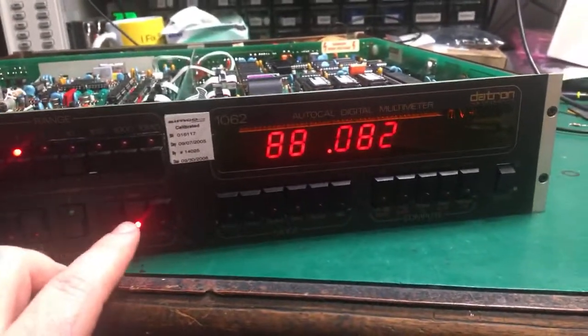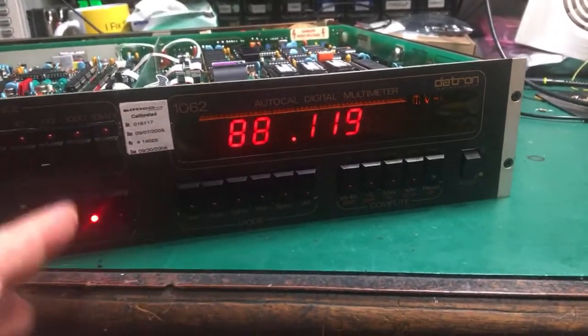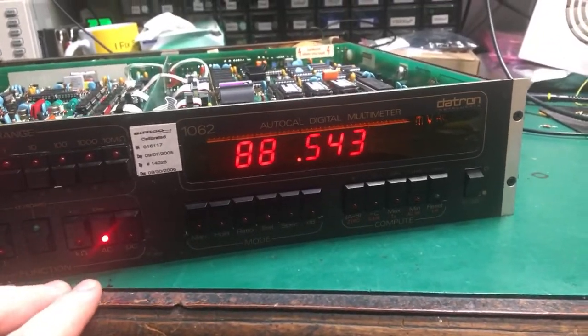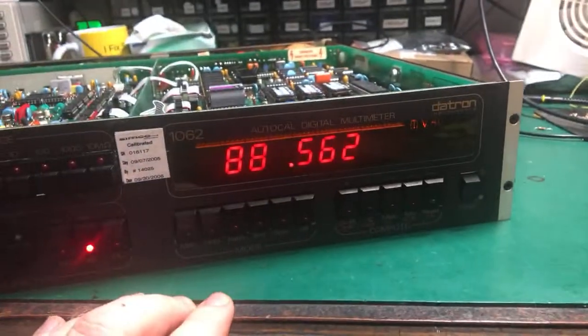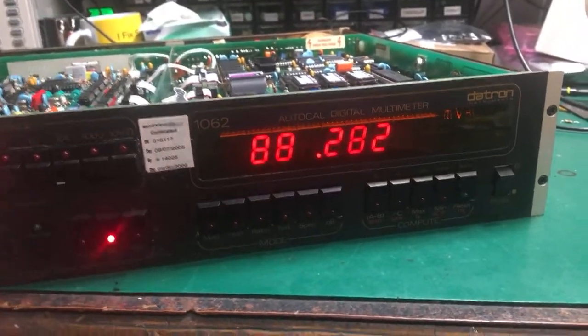What it was on the circuit diagram in the manual, the A and the G looked almost identical - you couldn't really tell which one was which. I took a guess and it was the wrong one. So anyway, I've swapped some wires around on the back of this PCB here, took the display back out again and it's working again now. So that's all fine.